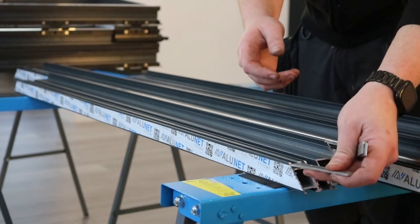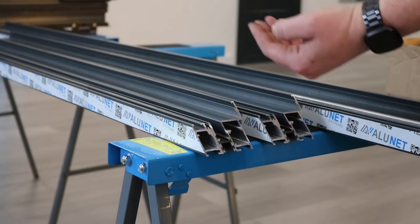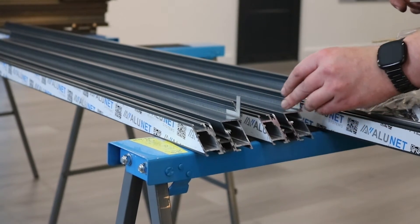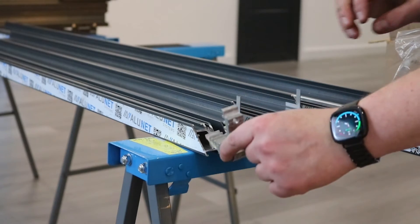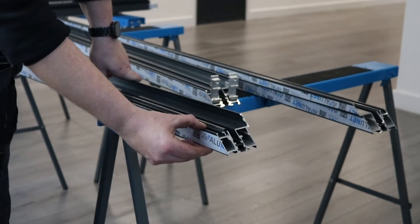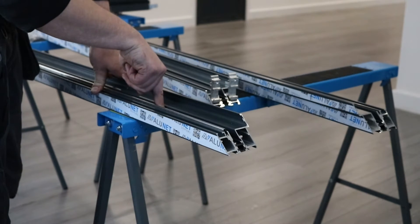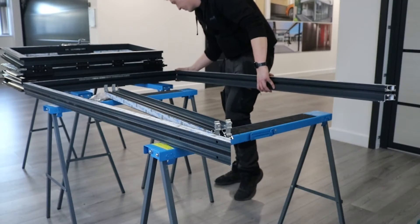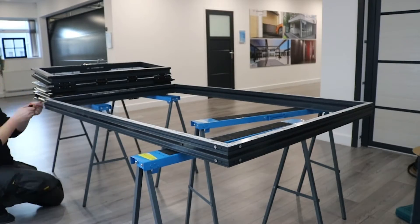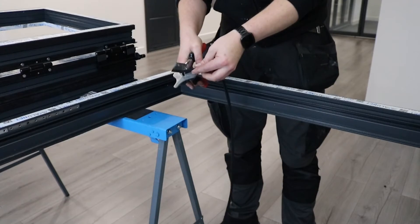Slide four hinge plates into the profile. If this door had a sliding post, we would be putting wool pile in here before putting the door together. Apply the chevrons to the sides — the hole is in the centre of the cleats this time so it doesn't matter which way around they go. Place two into the ends of each length of profile and repeat on the other side. Before putting the frame together, silicone the entire circumference and make sure to fill any chamber where there is drainage. Fix the frame together and screw each of the corners, making sure to line up the edges. Apply a flipper gasket around the upstand of the frame, cutting the ends at 45 degrees.